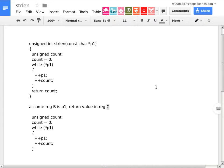If you have a slight look-ahead, then you can say, okay, this will involve this ALU, that will involve that ALU, and this needs the result of that, and so on. So internal to the processor, it can start to do optimization to reduce the time it takes to execute those instructions. Let's say you have 4 instructions. The first 2 can be done in parallel because they have nothing to do with each other. The third relies on the first, and the fourth relies on the second. So if you execute instructions one by one, you won't be utilizing all the ALUs in parallel, assuming all of those operations are register operations and none require memory access.